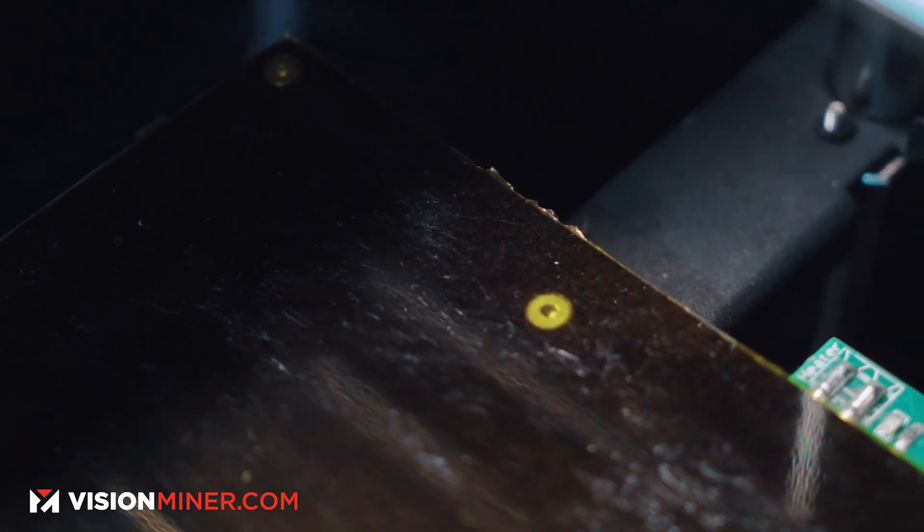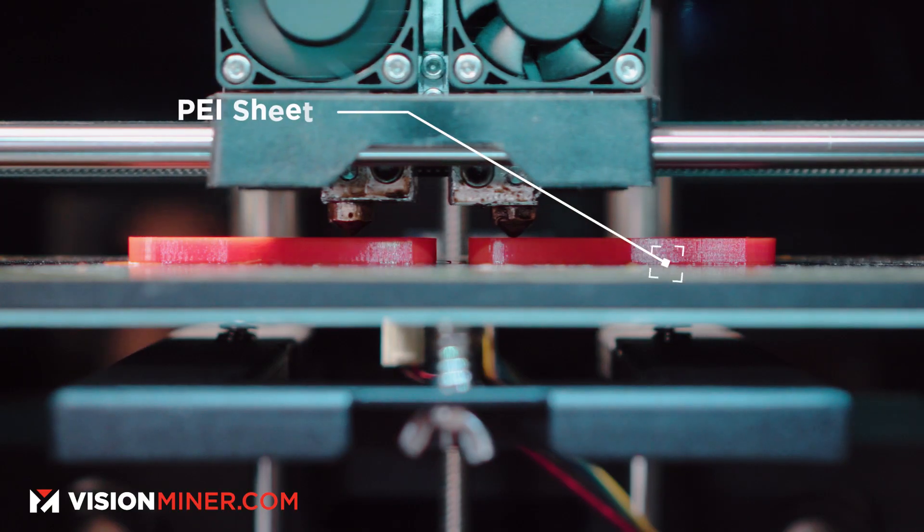Ultem is probably on the bed of your printer. It's in vapes because it can withstand extreme temperatures and won't absorb byproducts. I've had coils directly on this material accidentally and it just left a little mark — anything else would have disintegrated. We're talking about putting 40 amps through some tiny wires and it just handled it. It's a beast. If you have a weird yellow tip on your vape, that's Ultem. If you have a weird yellow sheet on your 3D printer, there's a good chance that's PEI as well.